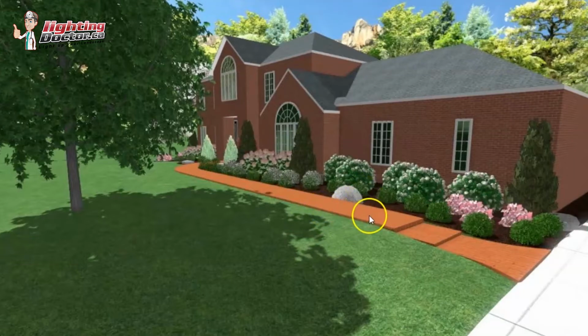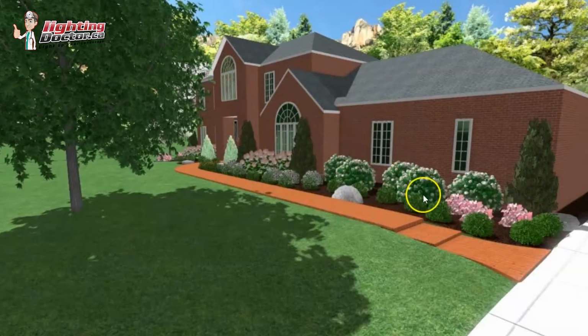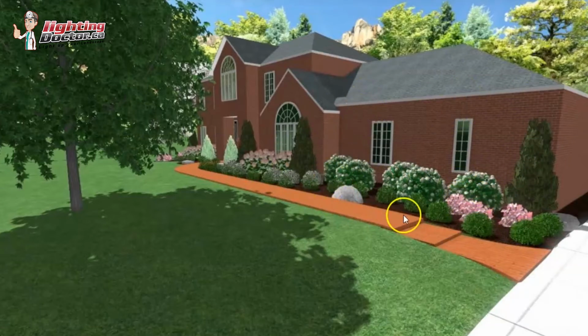And again, over here it's nice, whereas just to keep with that same theme as the rest of the house, I would probably just stick with the windows, where I would have my 2 uplights underneath the windows. Same thing on these ones. You don't need it as bright as these top peaks. Just that standard 4-watt LED like you would use here would be good in this area. But because it's so much more spread out, I think you would want a couple of wash lights in between the higher uplights to highlight some of those areas, and then maybe just 2 path lights tops in here. So ideally I would love to see 1, maybe 2, 3, no more than 5 pathway lights along this whole area, but then a nice contrast of some uplighting, which is going to be a little brighter, a little more intense, and then some wash lighting.